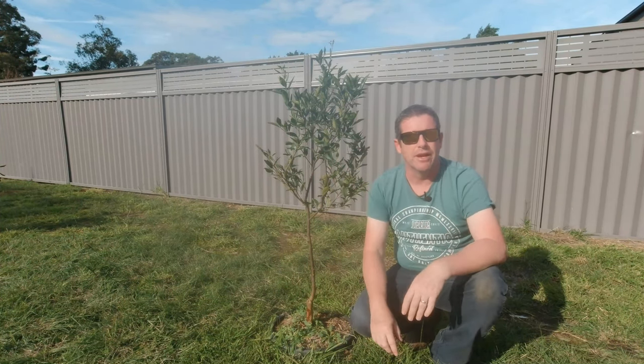Once you've got the rough shape that you want, what I do is I unclamp all the boards, I move them off to the side, and I face them side down, so that when you put them back, they're going back in the same curve that you've already had before, and you know it's going to work. There's nothing worse than picking up the wrong piece, trying to fix it into place, and it just won't go back in where you've got your stakes.